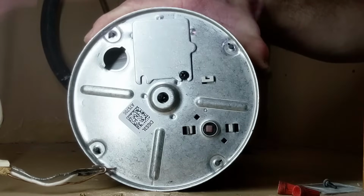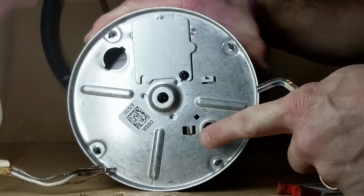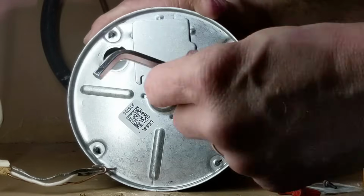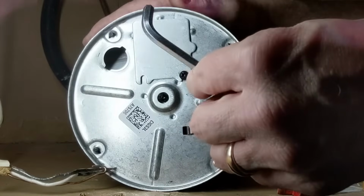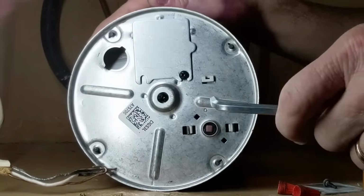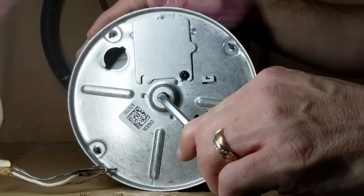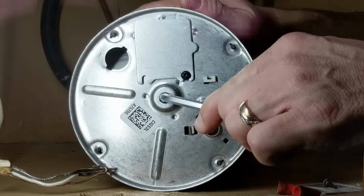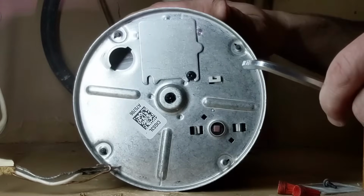So, real quickly, let's just talk about our new garbage disposal. This little button that's down on the bottom is to reset it if you ever need to do that. The other thing is, hopefully it came with some sort of a wrench. Hold on to this wrench, put it someplace. You could even probably just tape it right on the side of this garbage disposal so that you know where it is. You can insert this into the bottom, and if you ever get this lodged and it's clogged up real good, you can use this wrench to help you turn it to dislodge stuff on the inside.